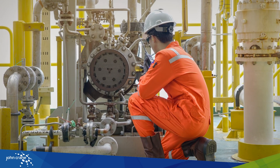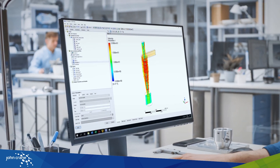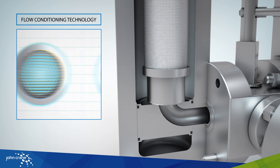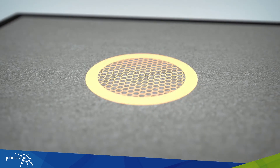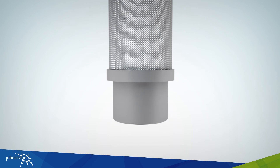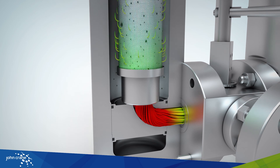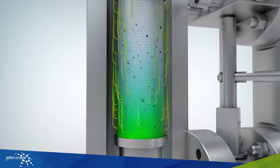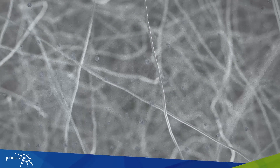Such flow inefficiencies are the cause of unplanned downtime, increased maintenance, and higher OPEX. Using computational fluid dynamics (CFD), a more efficient solution was developed to ensure the best protection for dry gas seal applications. The Indofill FCF series coalescing filters combines new flow conditioning technologies in a smaller unit. Additive manufacturing creates a custom flow straightener built into the inlet of each filter element — its honeycomb structure removes vortices and secures optimum streamlined flow. CFD analysis also showed that filter size matters: the ideal diameter-to-length ratio enables even flow distribution, further reduction in droplet re-entrainment, and improved coalescing performance. New hydrophobic-treated filter media improves droplet drain speed, removing contaminants of 1 micron and smaller at 99.9% efficiency.